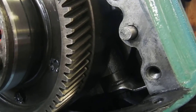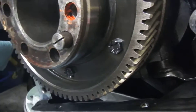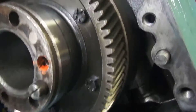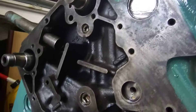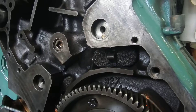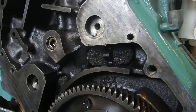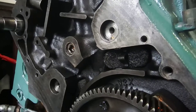This is the adapter. On some engines it would be an oil pan that would go right there, but that's actually the adapter plate on these. You can see it's pretty straightforward looking right in the end of the 8V71. The reason that plate's there is they can take two 8V71s and hook the blocks together and make a V16 out of them. Same thing with the 6s — you can put two 6s together and make a 12, and so on.